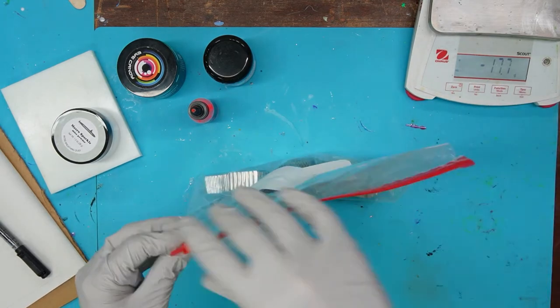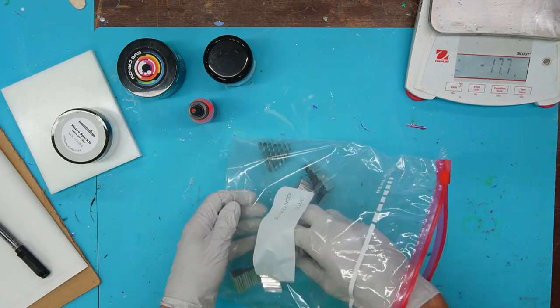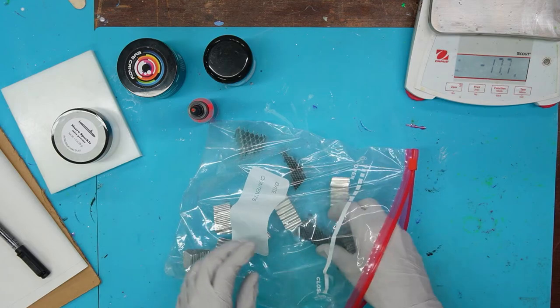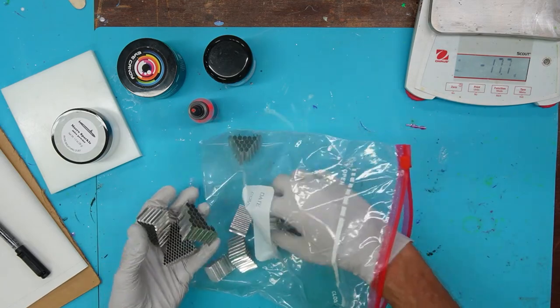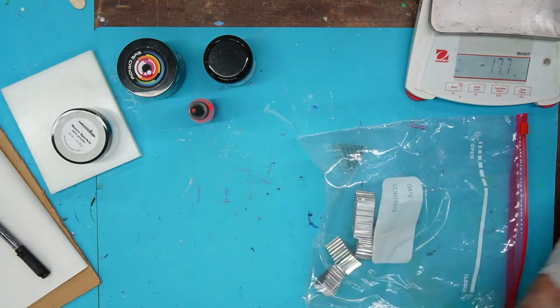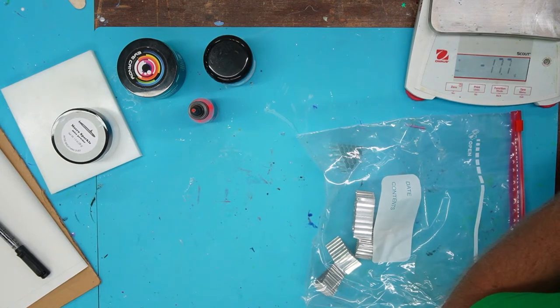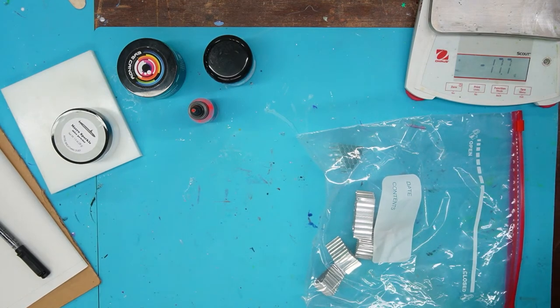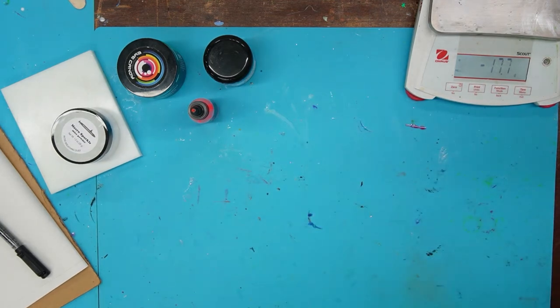I also don't think you really need to put the aluminum honeycomb in the oven for very long. It doesn't need to be super hot or anything like that. Just put it in for a little bit. I'm just gonna put it in now, a few pieces that will be ready to go. Just heat it up a little bit and you should be good to go. I don't know that it being hotter is gonna hurt anything either, but I just don't think it's fully necessary. Again, it's mainly just to flash off any surface moisture that you might have on there.